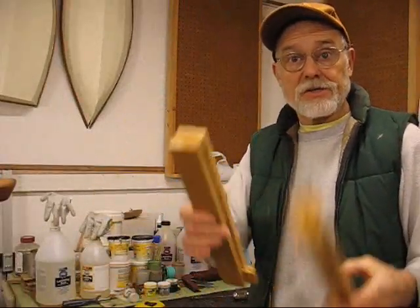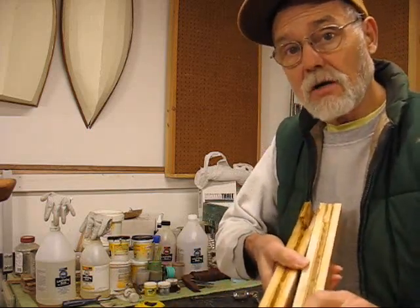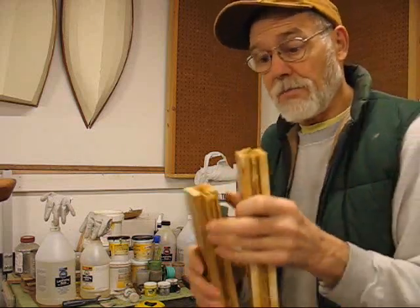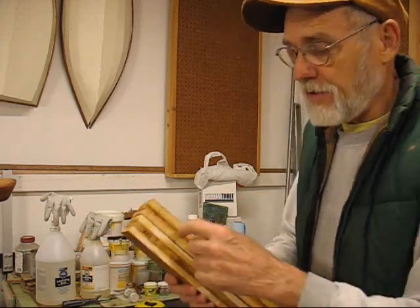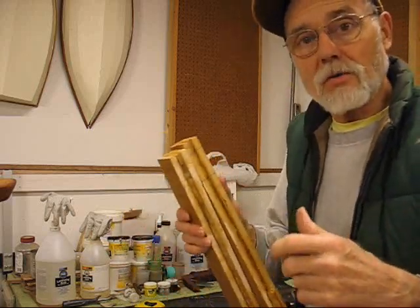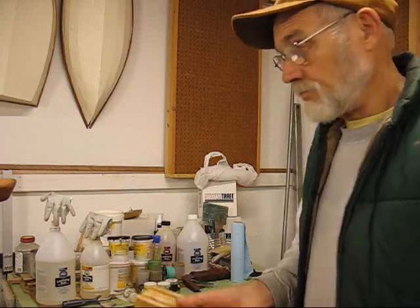The clamps we're making today are the long ones I need to get down over the gunnels to hold the trim in place. I got some half-inch maple backsplash from kitchen counters — a neighbor had leftover wood because he was a trim carpenter. I cut some half-inch plywood into strips about an inch and five-eighths by fourteen inches, with little tabs wider than the thickness of the rails so I can span them. I've pre-marked them at three-quarters of an inch, then two inches down, then centerline, and now I'm going to drill half-inch holes.